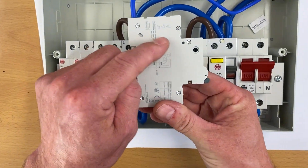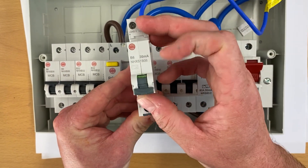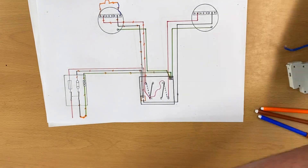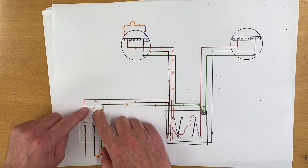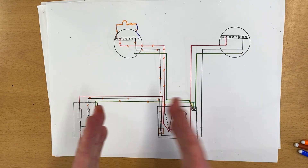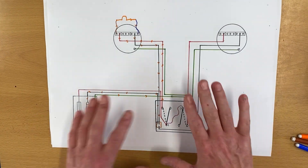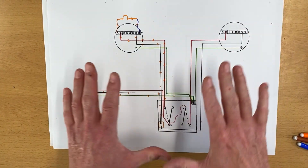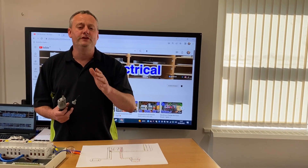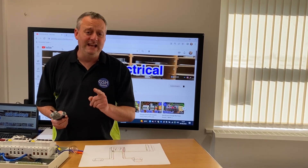Lots of manufacturers are now moving to a switched-neutral RCBO — you need to look on the side to see if you've got a switched neutral. When you've isolated the circuit and locked it off with a switched-neutral device, you disconnect both the line and neutral, breaking both at the overcurrent protection device. By breaking them both, you effectively remove the link which would otherwise exist further downstream on TN-S and TN-C-S earthing arrangements, giving that loop back. So you might do safe isolation and it doesn't beep — it's a combination of understanding what's happening in circuit to know whether you have a complete loop or not. Hopefully now when you do safe isolation and hear the continuity beep with no voltage present, you understand why.